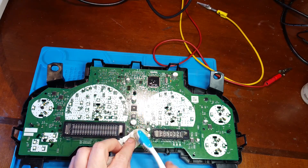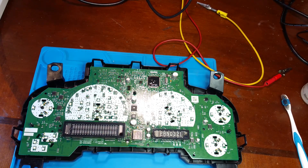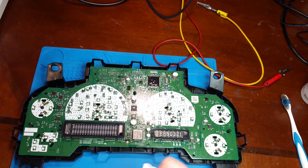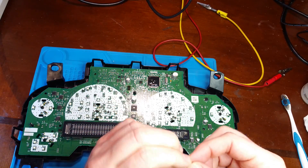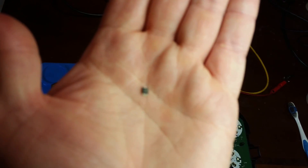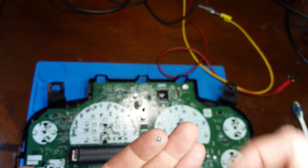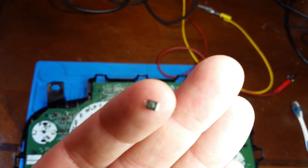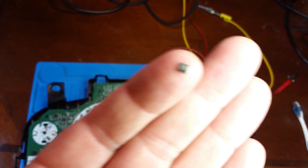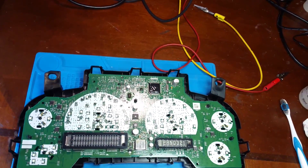When the resistor and chip both need to be replaced, it's not something your average Joe with a ten-dollar soldering iron is going to be able to pull off. The chip is tiny — the pitch is just so fine that you have to have a microscope to do a chip like this. There are four pins on each side. You would be nuts to try to replace this without a hot air station and a microscope.